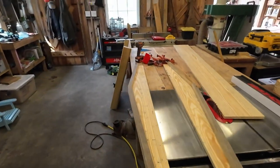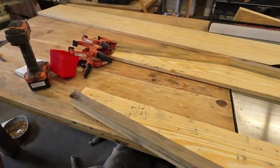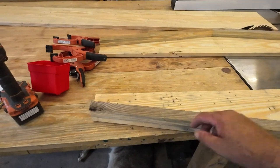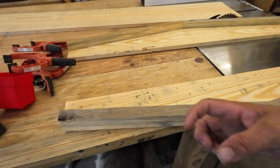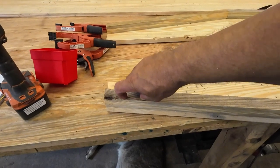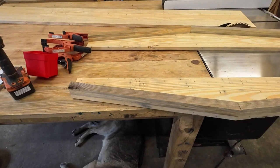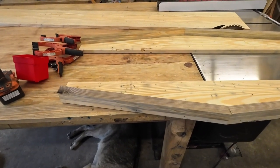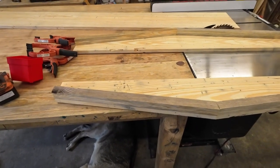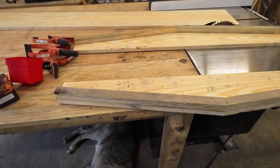But what I'm gonna do now is my vertical pieces. I'd like to notch them down into this so that the actual vertical piece is going to stick up, holding in to the bottom part of the framing instead of the boards that are making the side of the case holding everything together. That actually ties into the bottom of the framing, and that way when it's lifted up, you don't have to worry about those boards splitting.